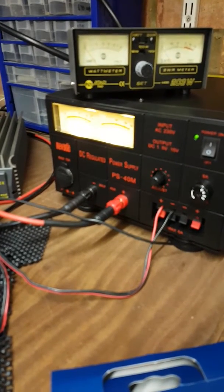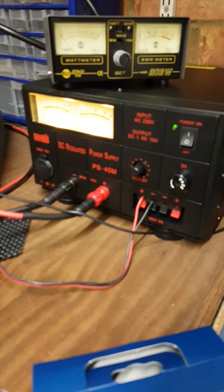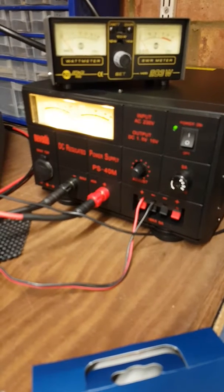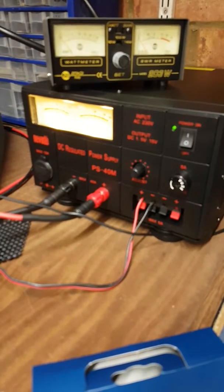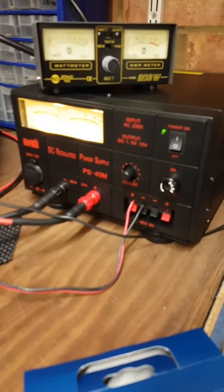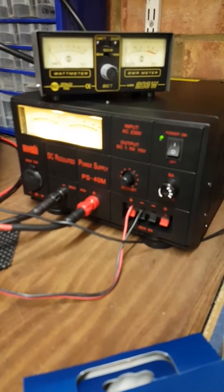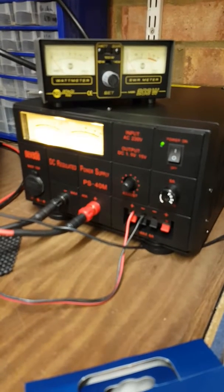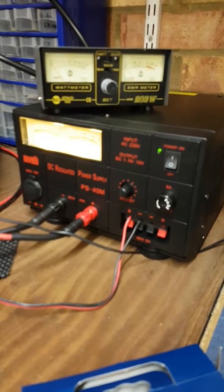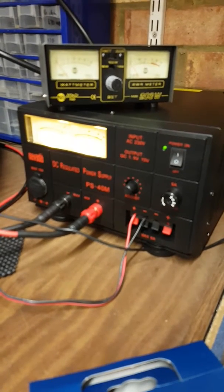This is the Nevada PS40M — it's Nevada branded but available from various manufacturers. Like its little sister the PS30 or 30M, it's very noisy because there's a thermistor which cuts in at 50 degrees and activates the fan at full speed. I phoned one of the suppliers, Radio World on eBay, and they said 'I don't know what reviews you're looking at, we sell loads, they're brilliant and not noisy' — but it was extremely noisy.